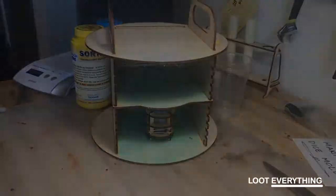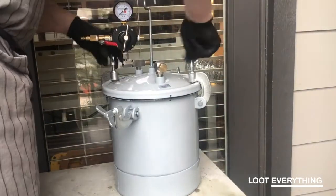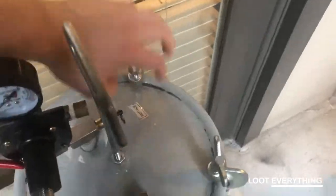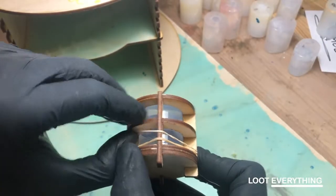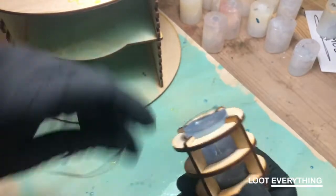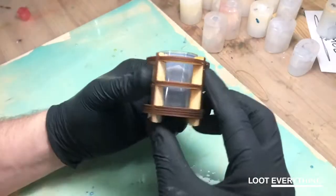Once the mold is full, I pop it into my pressure pot stand and use an air compressor to fill the pot with 40 psi of air. After the mold has had 4 hours to cure, I take it out of the pot and have a look. This is where I find having the wooden rig is really useful. Everything comes apart really easily and is just ready to go right after that for another cast.